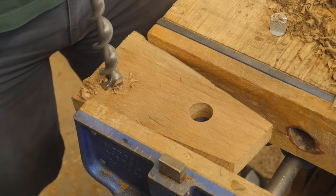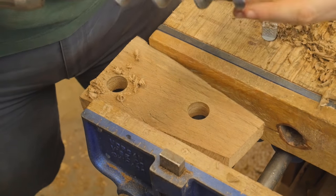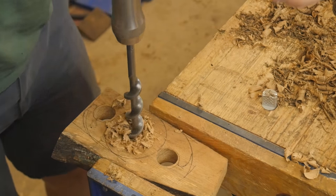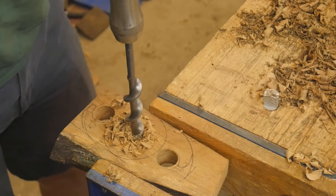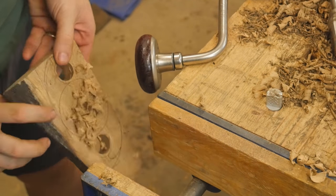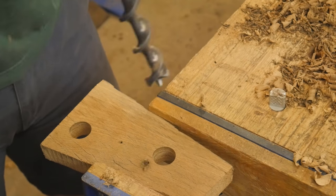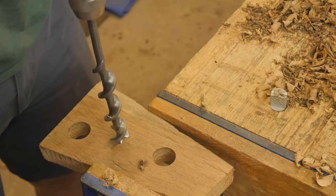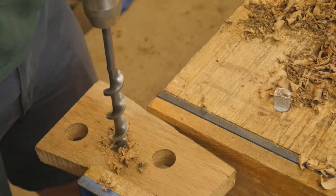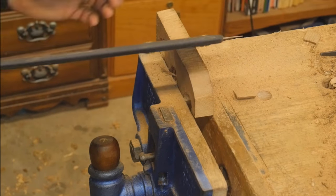For the middle hole I had to be very careful, so I drill from one side and then come back from the other side, and it gives you a really nice clean hole. These auger bits are great for giving you a very clean hole, but if you go all the way through they're going to blow out big time. So I go through until I can feel the point sticking through on the other side, then flip the work over and center the auger bit in that little hole to get an exact matching circle - a very clean entry and exit on both sides. This hole needed to be slightly smaller than the one-inch screw so that I can thread it out.